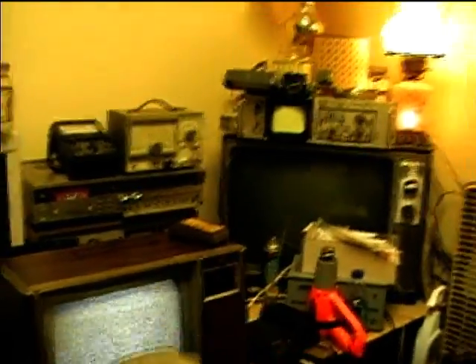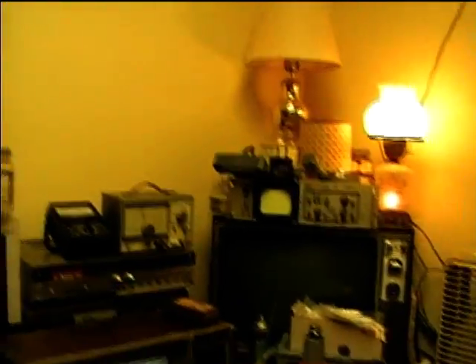What you need to do is remove it slowly because the magnetic field penetrates for a while. If you were to shut it off right near it, you'd end up with a magnetized CRT. So you have to move it at least four or five feet away before shutting it off. Now I'm going to go take it out and test.